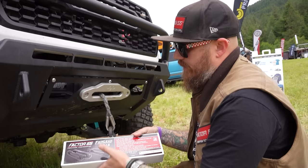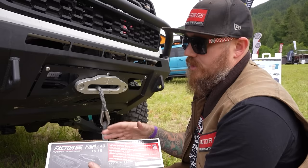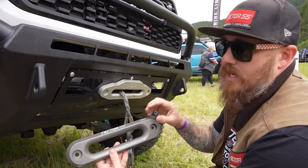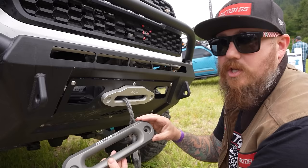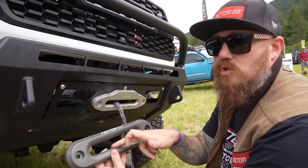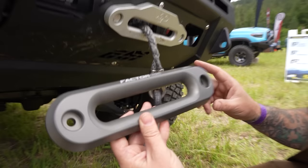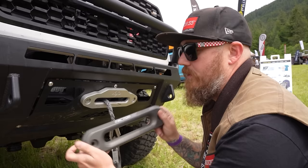With our fairleads, they're mil-spec type 3 hard anodized. They're machined out of USA-made Kaiser Billet 6061 aluminum alloy. They only come in this gunmetal gray color because when you hard anodize 6061 aluminum alloy, the end result turns it this color. It's two mils thick — one mil gets infused into the material itself, and there's a mil thickness on the surface — making the surface as hard as sapphire. So grit, dirt, and the winch rope won't scratch the fairlead surface, and you get a larger outer fillet radius to dissipate heat and friction as your rope pulls in at any angle.